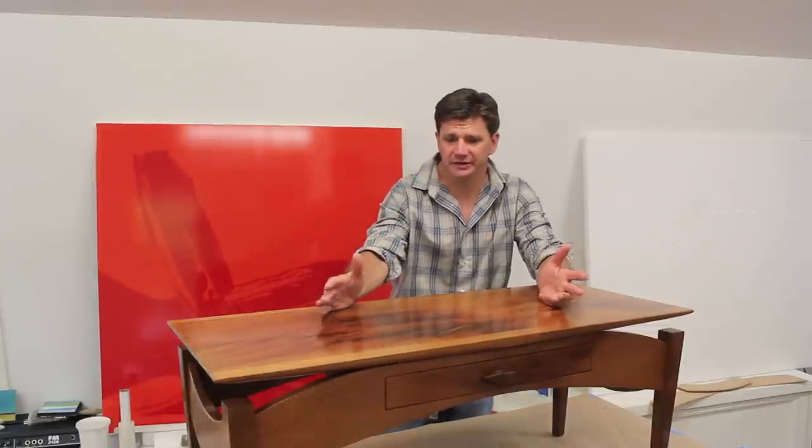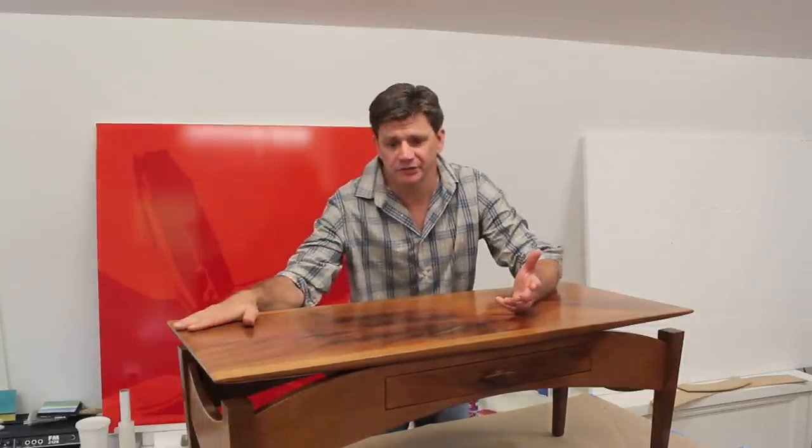I'm not going to video the several additional coats of finish on the top since I'm just repeating the process of sanding with 320 and reapplying the Waterlox with a clean cotton rag. I hope that didn't get too boring — I know some people are really interested in design ideas and wood species, and some people really just don't care. If you got something out of it, please leave a comment, like me on Facebook, subscribe, and check out johnpeters.com. Thanks for tuning in — I'll see you next time.